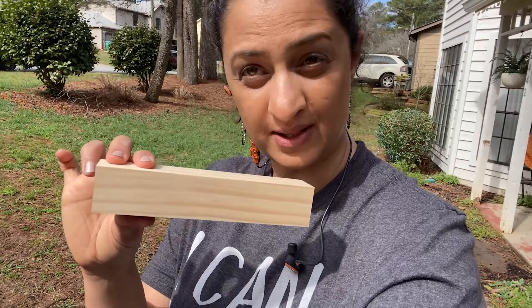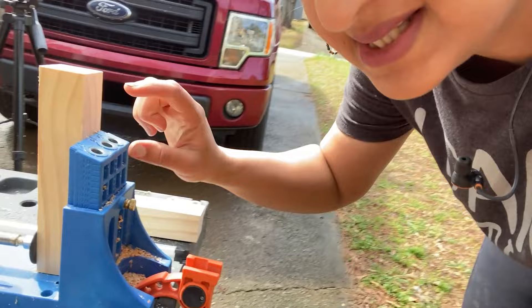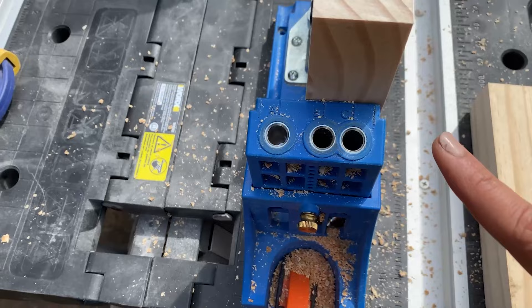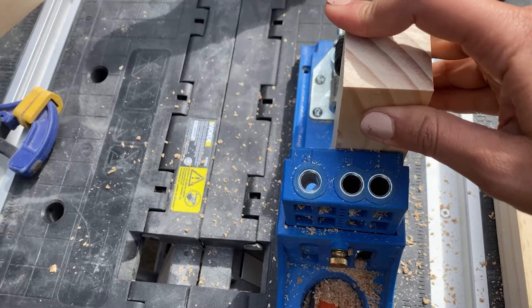So we're making pocket holes in these two-by-two boards that are going to be the shelf supports. Whenever you make pocket holes, you want to use the thickness of the material to set your drill bit as well as your drill guide. This is the Kreg K4 that we're using here. Two-by-twos are one and a half inch thick, so that's what it's set at. You always want to make at least two holes in each board, because if you make only one hole, it's going to be a pivot point and the joint won't be strong enough. Always double check the thickness of your board before you start, because there can be thickness variations. I have lots of resources about the Kreg Jig on my website, and I have a video class that takes you step by step through the whole process. I will have Sarah add a link in the description below.